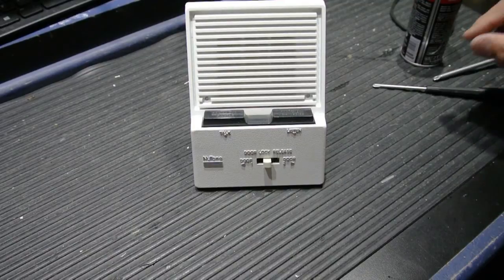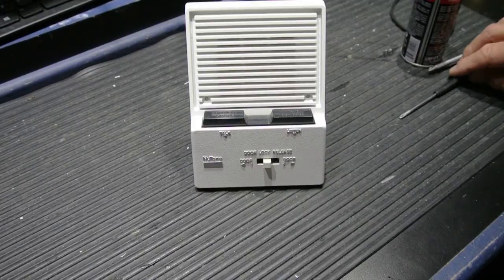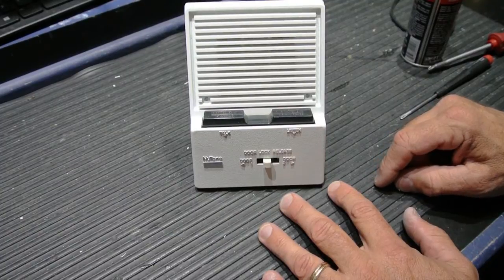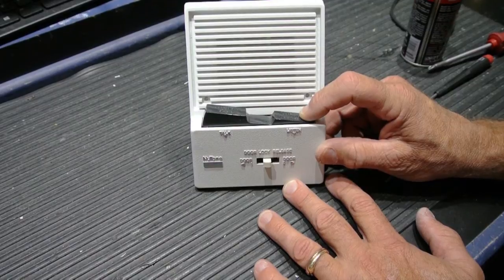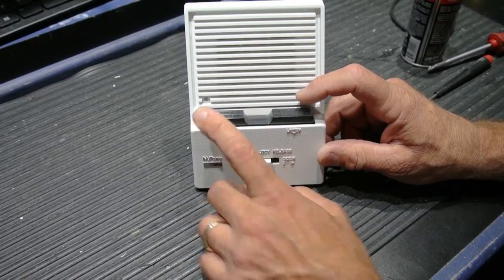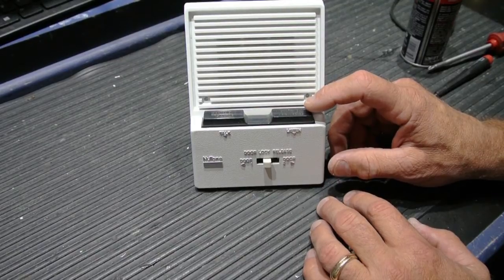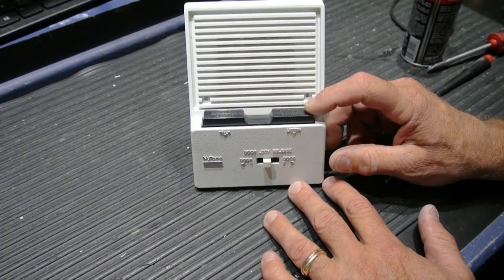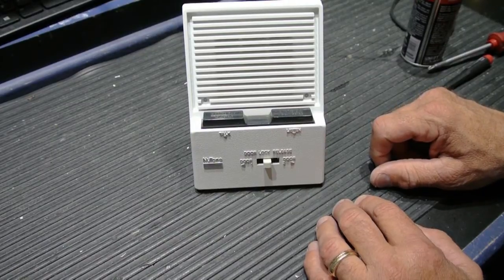The #1 service call that we get from building owners or management companies has to do basically with the intercom system only operating in one direction. The most normal complaint is the person in the apartment can hear the sounds at the entry, but they're not able to talk to the person at the entry. And why is that? Well, the way a NuTone 478 apartment house intercom system operates is by flipping the direction of the conversation from talk to listen with a relay inside the control unit.